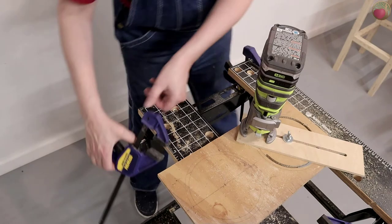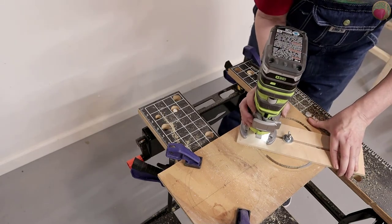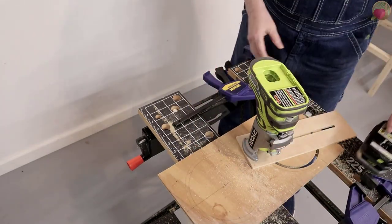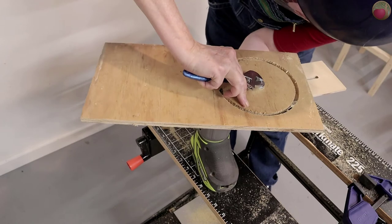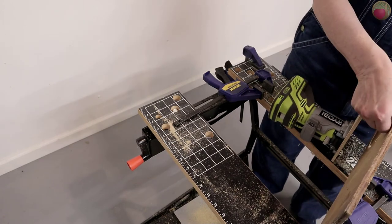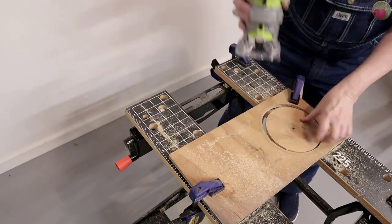Second, keep in mind that you're cutting out the piece of wood that your jig is mounted to. I stopped at the three-quarter mark and moved the cut-out circle onto the far side of my workmate so that the circle itself would be supported as I finished that cut. Your jig is mounted to a piece of wood that may become too unstable to support the jig as you near the end of the cut. I chose to remove the jig and put the base back on my trim router, then free-hand cut the last inch of the circle. That way I could ensure that I kept the jig level and the circle could simply fall out.